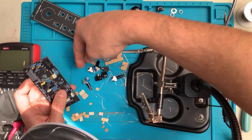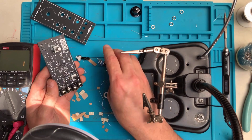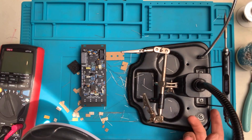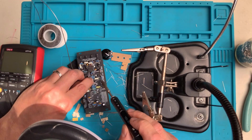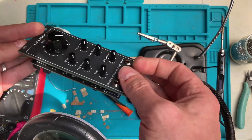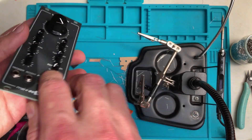Let's plug in the power connector and go on with the hardware — jacks, pots, all trimmers. Slip on the panel, tighten the nuts and solder on all the hardware components. Give your build a nice visual inspection, check the power header for shorts and you're done. So let's go check these out now — I'm going to put together a little drum machine with these on and we'll hear what they sound like and what they can do.